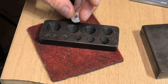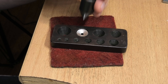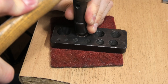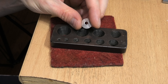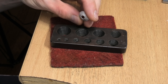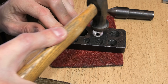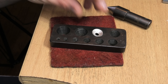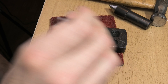I can feel it's gone rock hard but so far it's working. I'm going to anneal it and then do a bit more. The hole is really taking a beating - I should have made it a bit smaller. I think it goes in there... not quite. Maybe I'll start on this one. I'll anneal it again and then go on this hole.